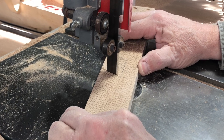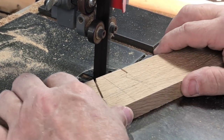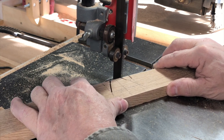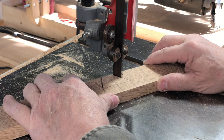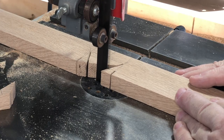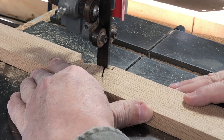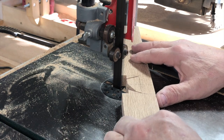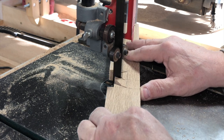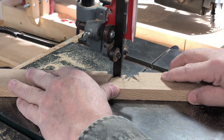Hardwoods are a little more demanding than softwoods because they require tighter accuracy in a fit like this. But if you're working with plywoods or softwoods, you'll find that you can compress the fibers in wood to make something that's a close fit. These types of joints are so strong because they give you a lot more surface area for glue. But remember, we're not going to glue these up just yet. A joint like this will fit very tight even in the dry fit, and it'll be very strong. So whichever tool you use, be mindful of this and take your time. Move slowly and as precisely as you can, and it'll save you a lot of time in the long run because you won't have to do these joints twice.